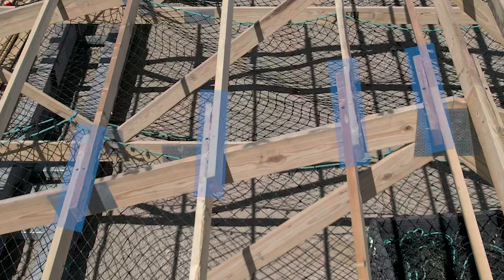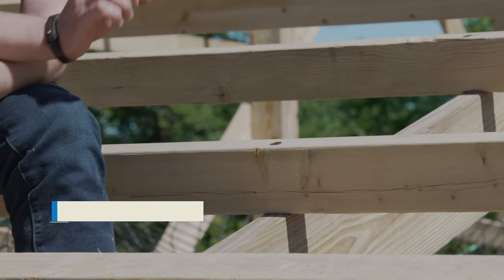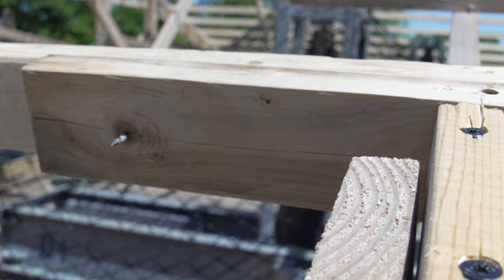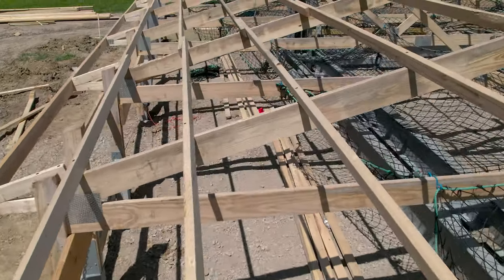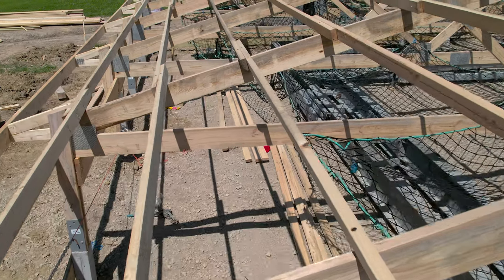Butting can look a little smoother but ends up having less lumber on your roof and can be a little less strong. The last point about purlins is screws versus nails. We've moved to a screw that goes into the purlin down into the truss — it gives you a stronger connection versus hammering a nail. There's less chance of missing, less chance of damaging your purlin, and a screw is always stronger than a nail in these applications.